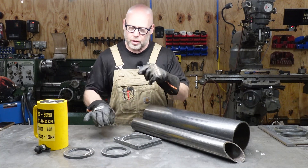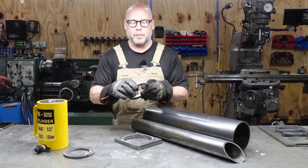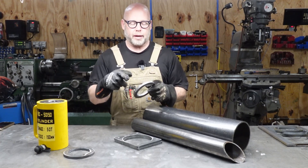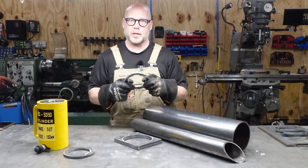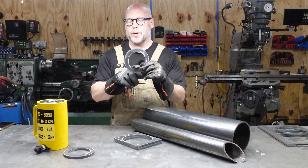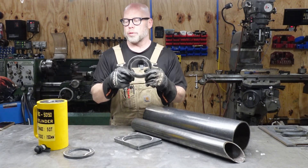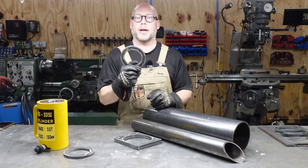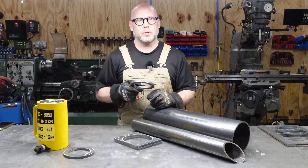The rings that go on top — same thing, there's a little bit of a bevel to the edge, but overall they came out well. We're going to put them in the lathe and true up the outside of the rings, then true up the centers to get them cleaned up. The centers don't really matter that much since that's just a pass-through for the ram — all this is is a ledge to support the body of the ram inside the pipe. We're going to go get set up on the lathe first, knock out these two circles, then come back to the milling machine for the mounting plates.